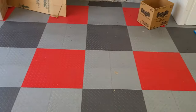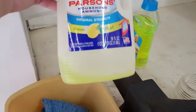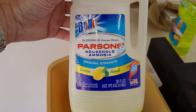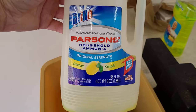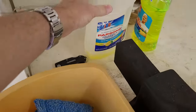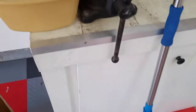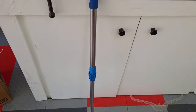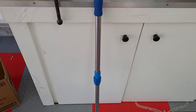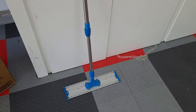We're going to get it cleaned up. What we're going to use when we clean it — this is our favorite cleaner to use on interlocking floor tile and floor coatings, epoxy, polyurea, et cetera — is Parsons non-sudsing ammonia. We generally use a quarter cup of ammonia to one gallon of warm water. We use this microfiber mop pad and this industrial mop right here. It's as old as the floor, which is seven or eight years old, and it works fantastic. I'll drop a link down below — it's a popular item that people find on our website and purchase through Amazon.